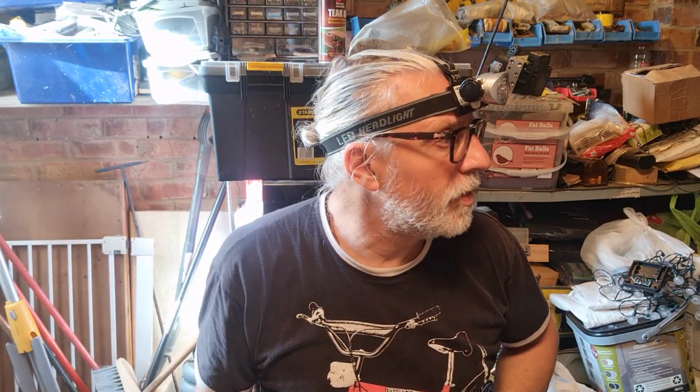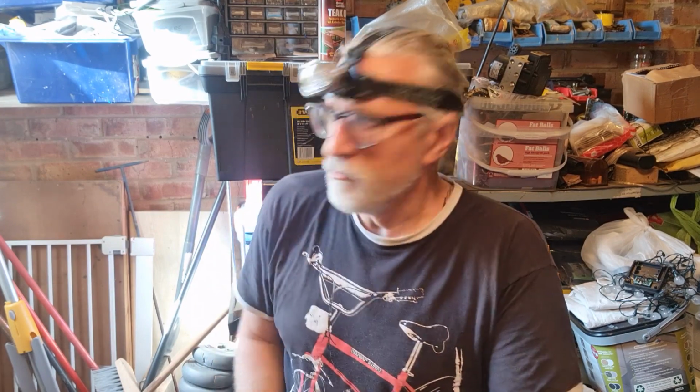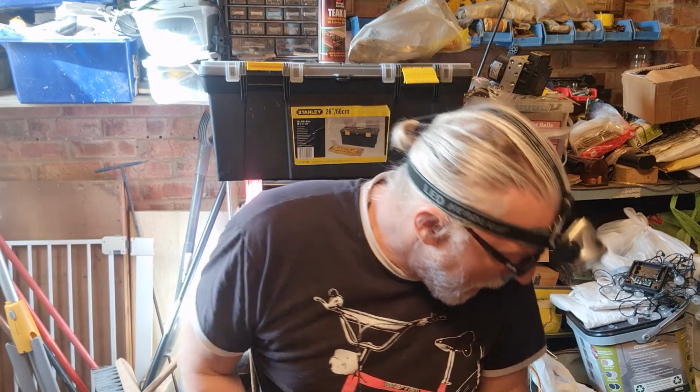Anyway, that over. Because I put an isolating valve up there, I just turned it off and I thought, right, everything from that valve is going. Well, apart from the tank. So, I nipped over to Bravo, Quebec, got myself a new ballcock valve, got myself a new isolating valve, got myself a bag of olives. I thought I'd treat myself. And, yeah, I got cracking.